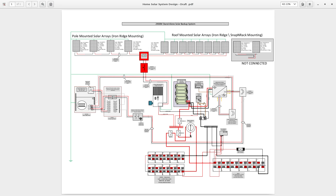The battery selector switch is connected to the positive bus bar through a 250-amp circuit breaker at the common terminal. It has two positions: battery bank one and battery bank two. Turning it one way draws power from the secondary battery bank; turning it the other way draws from the primary battery bank.